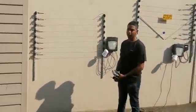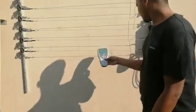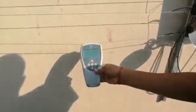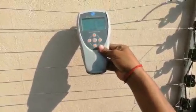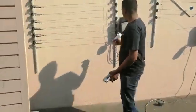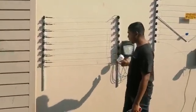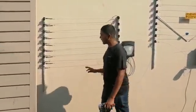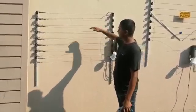It's going to be quite costly to repair. Let's measure the voltage on this fence — you can see it's showing 1.5 kV, so the fence is on. Now, the way the power travels in this fence: it will travel on the first wire, but the bridge is on this side only, not going all the way along. That basically means the power doesn't travel all the way along this line.